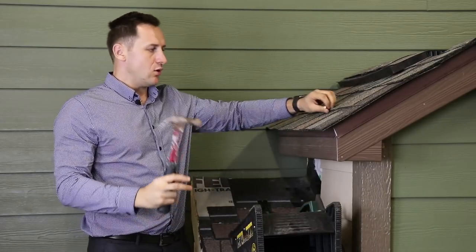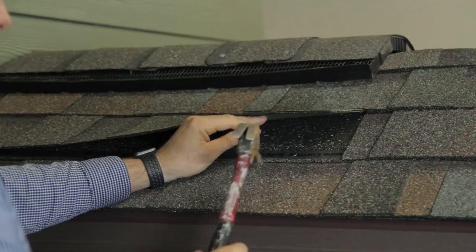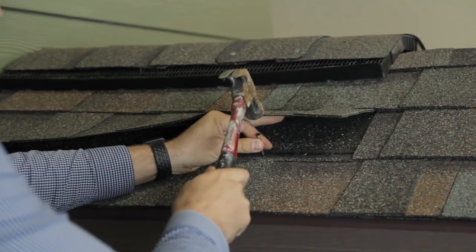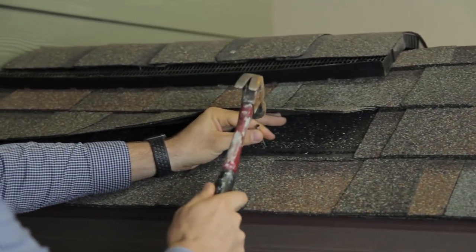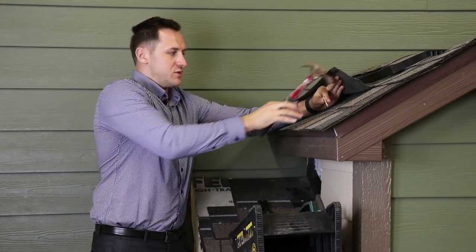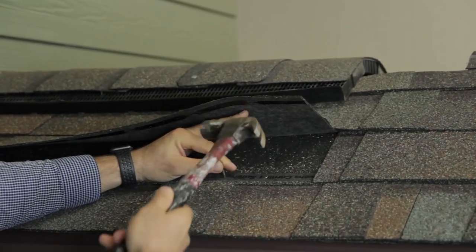But the key is, old-school, if you would have to add a nail to the nailing zone on a shingle that already has a top course above it, you can really easily damage the shingle by hitting it. You can also damage it by crimping it on the back. It's doable without the tool — it's absolutely doable — but it's much harder.